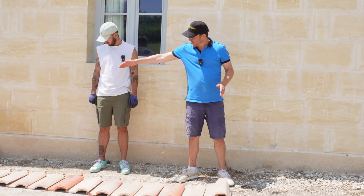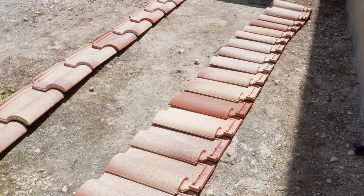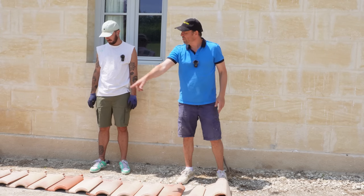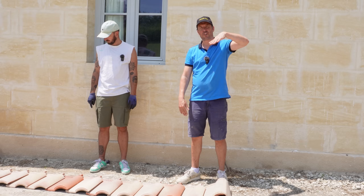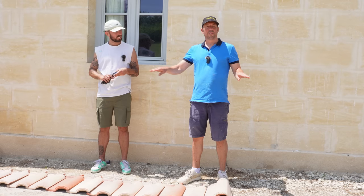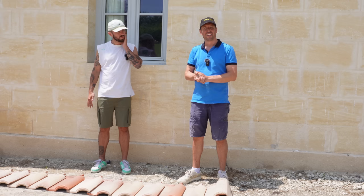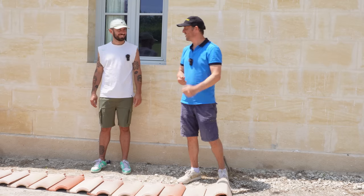So this is my width tiles here, and that's my length. So this width here is bang on 4 meters, which is great because my wood's 4 meters long. And then the length is 4 meters 34. So that means I've got a kind of pitch of about 20 degrees. It kind of falls within the limits. So normally you'd have a kind of lining underneath the tiles if you're going to be at like 19-20% fall, but it's only outside. It's only a bar area. Let's get going. Crack on.